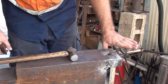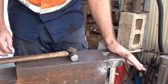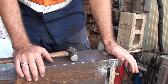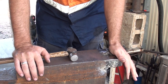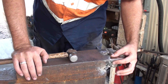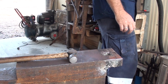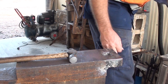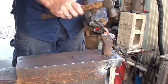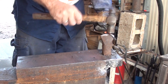This end of my anvil is a little bit shinier than it has been in the past. That's because working out here the other day I broke my end off. This is a homemade anvil and it was only stick welded to begin with — not very well originally — so it lasted eight months before I broke it off. I had to grind and re-weld it back on. It's a little less messy at the top because I've ground it off, but underneath it's still rather rough. Hopefully it holds up for another few months. The fuel I use for my forge is charcoal, which is why you can hear the popping and crackling in the background.